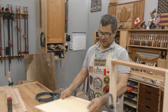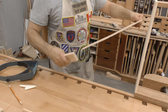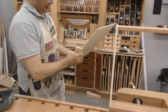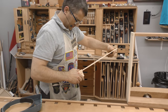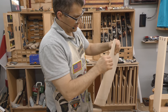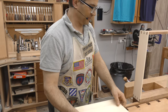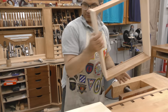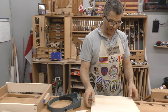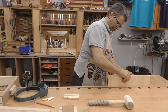I'm going to run this again to make sure — okay, so that slips through easy enough that I don't think the problem is in this thickness. I think the problem might be in the length. I don't want to lose that bottoming out fit that I talked about, that makes the drawer so strong.